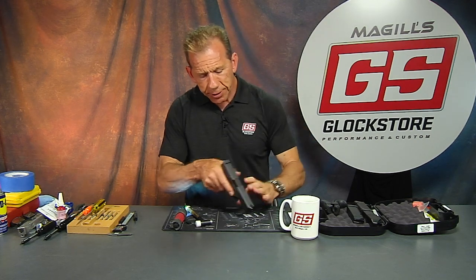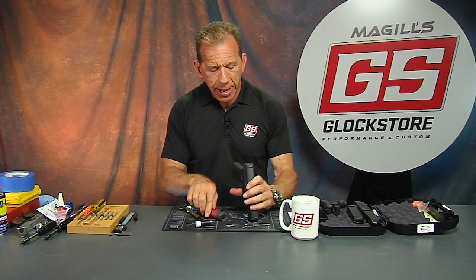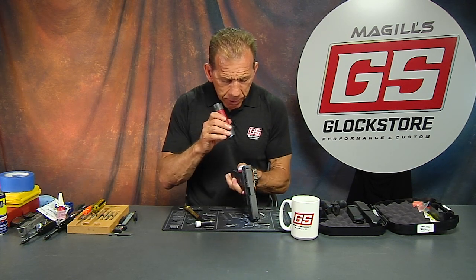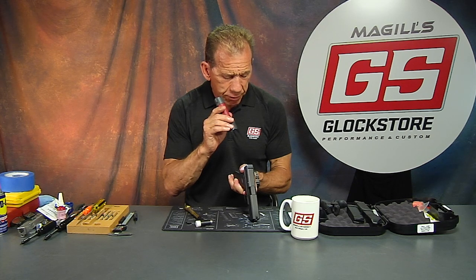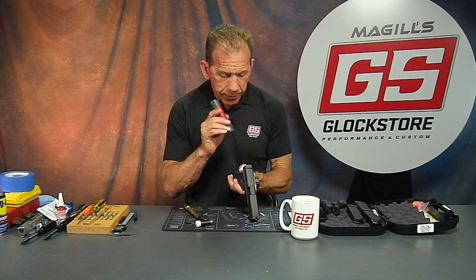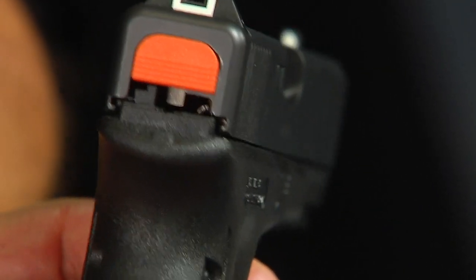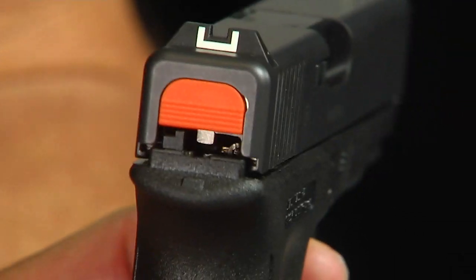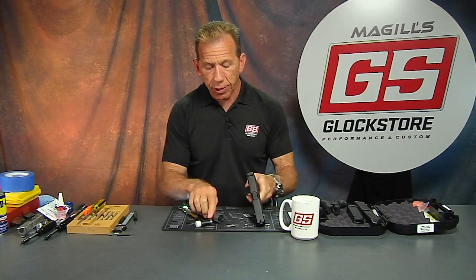An armorer will put this piece on, look inside, and diagnose what's happening. The Glock armorers class recommends having at least two thirds of the trigger bar onto the actual lug of the striker — you don't want it so low that it might slip off inadvertently. Looking in here on this brand-new gun, I can see good coverage. An armorer might say the trigger bar is bent or worn, or the striker is worn, or assess the connection: maybe 85–90% coverage of the bar on the striker. You squeeze the trigger and you see the cruciform fall off and the striker go forward.